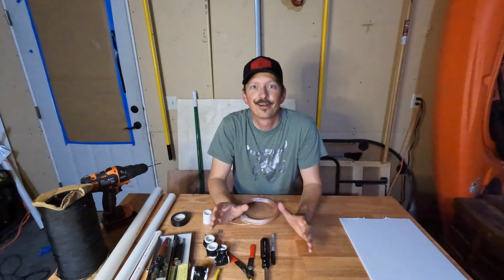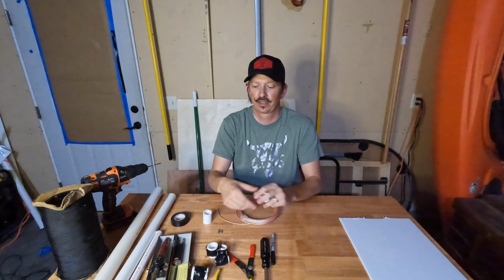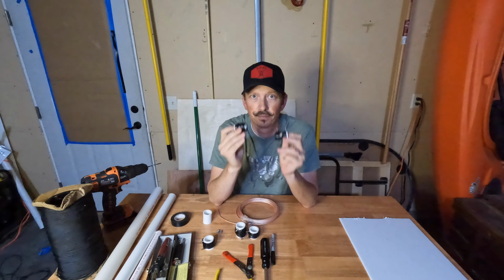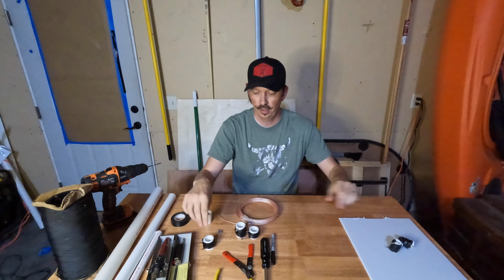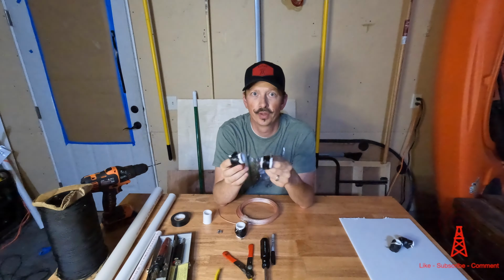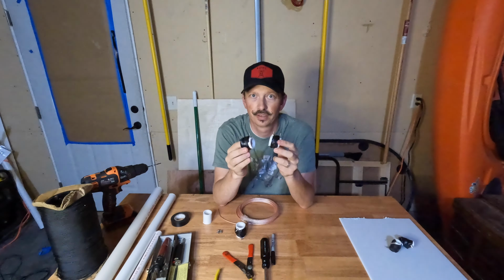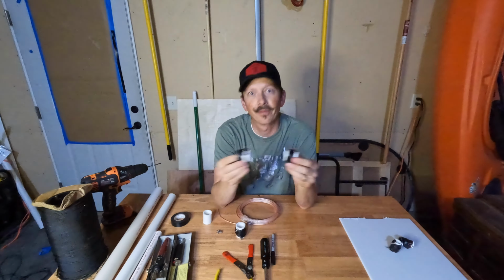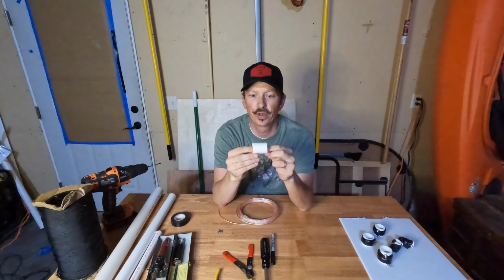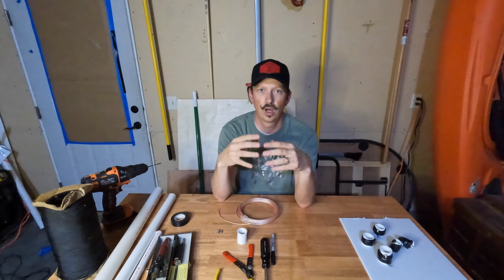All right, now that you are all educated up on traps and how they work, we're going to go ahead and build some. So I took the liberty of building a few to get started. I've got a pair for 6 meters. I've got a pair that would work on 10 or 12, just like we talked about. They're actually tuned for 12, but I can use them for 10. We'll put 10 up on this antenna just in the spirit of technicians getting on HF. And then I've got one 20 meter trap built, and we are going to build the last one. And then I have the materials also for a 40 meter trap.